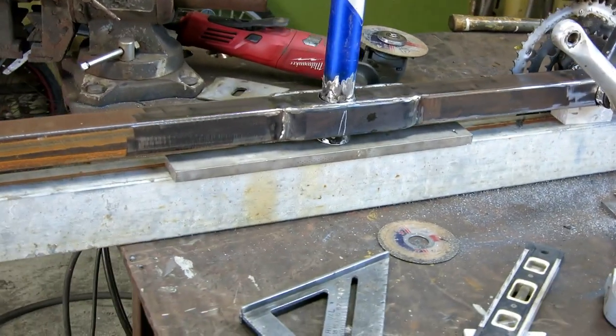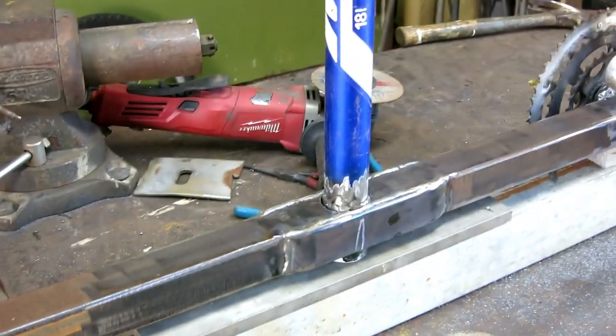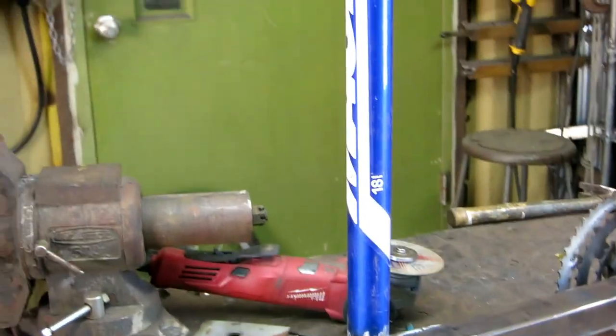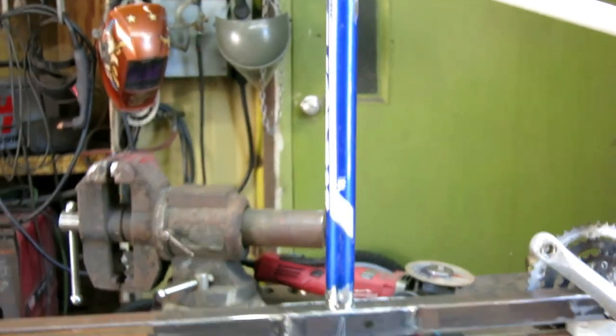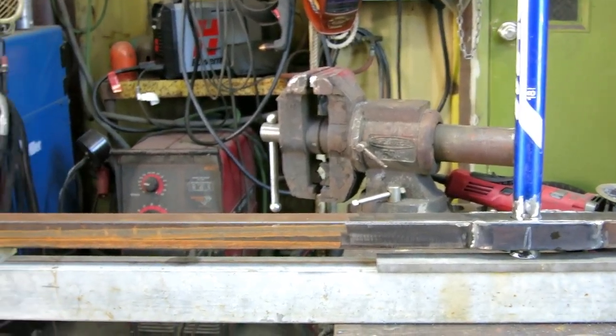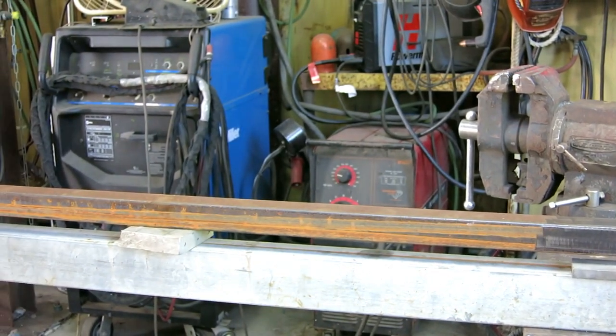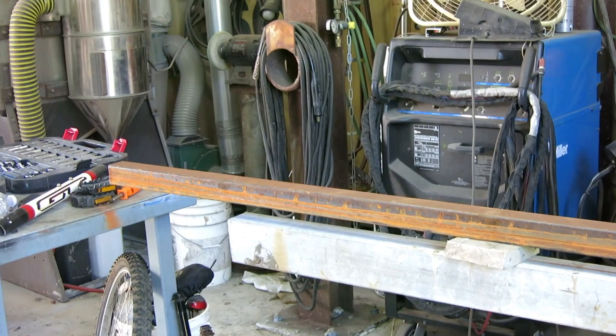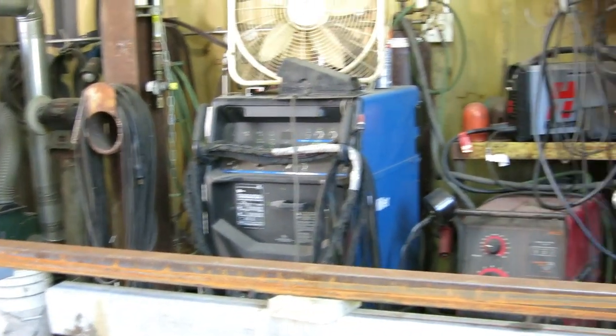So I've got my braces welded onto the side of the square tube, and I bought a hole saw the right size and I drilled it, so now the down tube is sitting pretty. That's where it needs to go. Now I need to decide how far forward I'm going to go with the storage part before I turn it up to catch the front forks. And that, I don't really know.